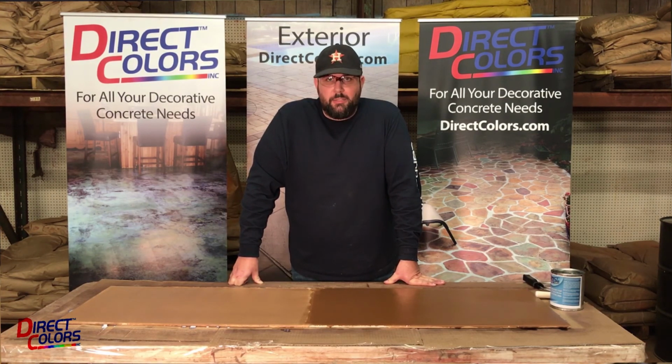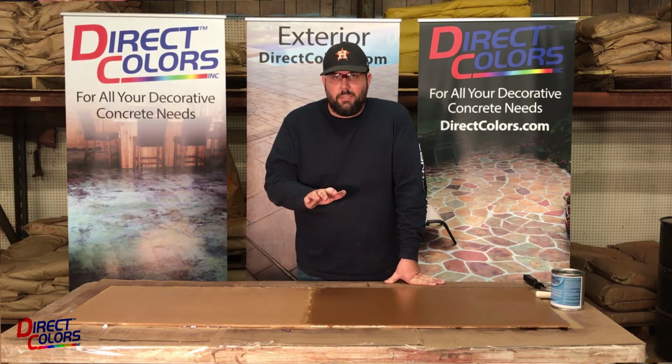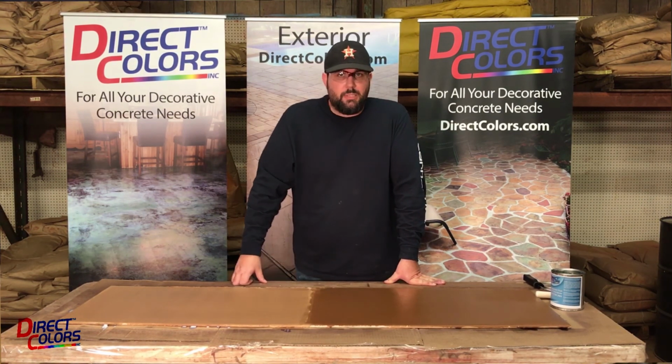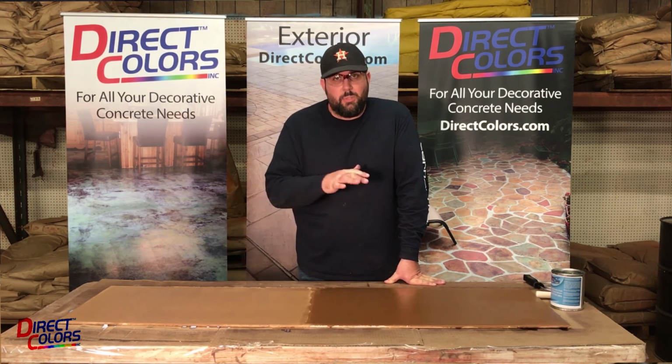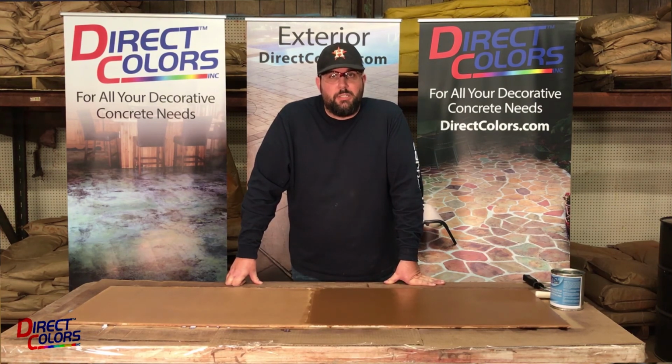You do need a maintenance coat because after a little while you're going to get micro abrasion and wear, especially in your high traffic areas, and it's going to dull the surface a little bit. If you just went with sealer and tried to spot treat with the sealer, it's going to stand out like a new penny compared to the rest of the floor. As opposed to a floor wax and polish, you get your floor done, with that high traffic area, spot treat with the polish, and you're in good shape. You don't have to do the whole floor every time.